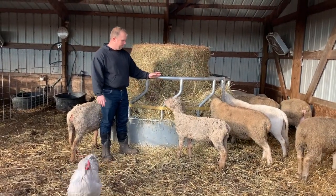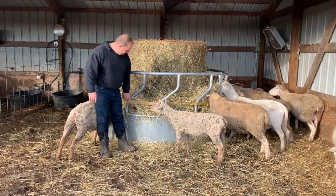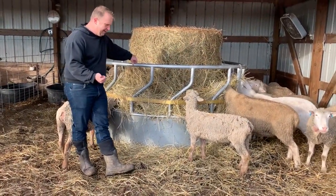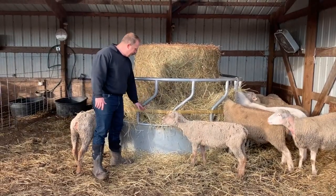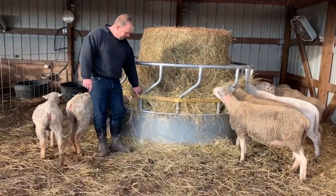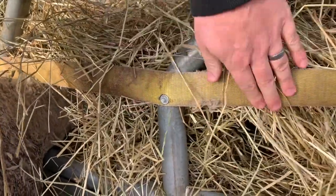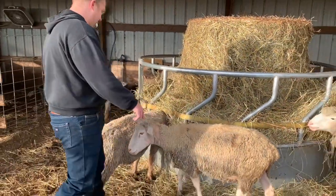The openings were too big and the animals were able to jump up in there. The way we got around that was we utilized a tie down strap. We put it around at about a six inch gap. What that did was it prevented them from jumping in — but then the sheep found out they could get their head underneath and manipulate the strap to make enough room to get back in. So I took some regular sheet metal screws and drove them through the tie down strap once I got it tightened down, which prevents the strap from being able to move. As you can see, not a whole lot of waste.